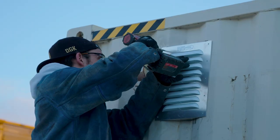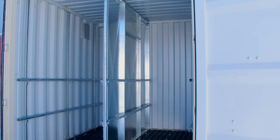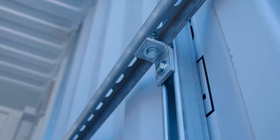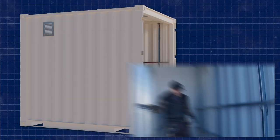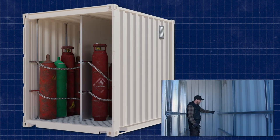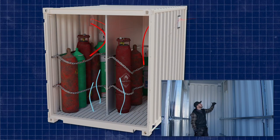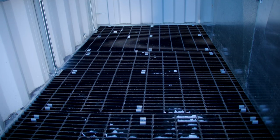All that's left to do in this container is install the two top vents and the horizontal slotted strut, which will retain the gas cylinder bottles. The container is all buttoned up now. Partition walls are in with the slotted strut on both sides of it, and slotted strut on the wall as well — installed with our two-hole angle brackets and the spring nut into the side channel. If it gets to site and they need the strut to be higher or lower to fit shorter or taller bottles, they can do that — it's super modular. The bottles will be stored inside and they'll be able to ratchet strap, bungee cord, or chain to hold those in place and stop them from falling. Here's the upper vent with the bug screen — that's a big air 45 vent that will exhaust all vapors lighter than air, and all lower vapors will exit through the metal grated floor.